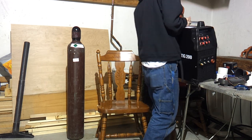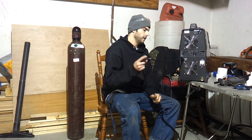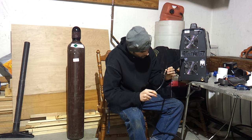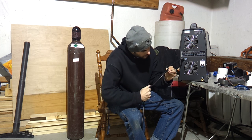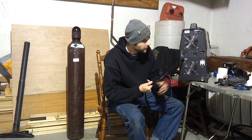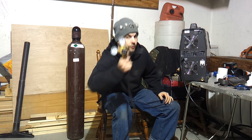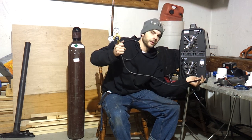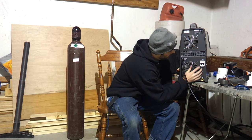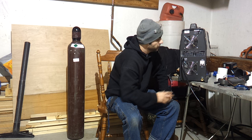It's pretty nice. Let me show you the back. Nice thick cord — it's all 12 gauge by 3.31 millimeters. That's the cord going in. Then you've got your argon hookup for your regulator that screws right in there and screws into the tank. There's also a breaker switch — it's actually like a breaker rather than just an on/off switch — to turn the machine on and off.